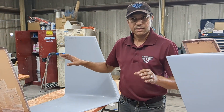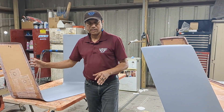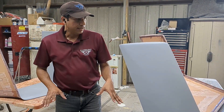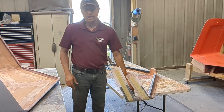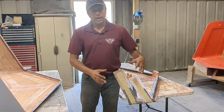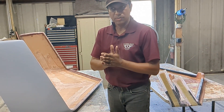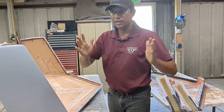These are mil-spec glass 7781 that we use in there — a military spec composite material, not just like your boat-grade fiberglass. In the rib section, we use both carbon fiber and composite and foam together. Once these things are dry, they're put together with methacrylate glue, which is a structural glue. It's stronger than the substrate, meaning the glue will actually not come apart — it will tear the layers of fiberglass apart before it gives up.